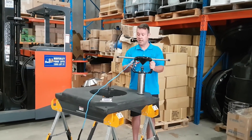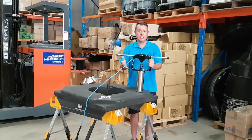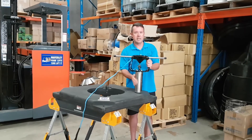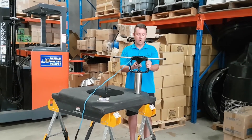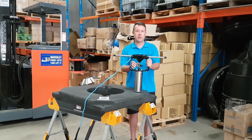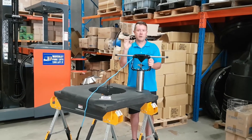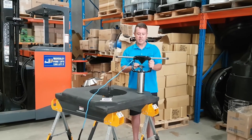All you have to do is every few months just come in here and wipe the outer cage of the motor to make sure that you don't get a biofilm building up on it, which acts as a thermal blanket and causes it to heat up. And being how easy this is to use, you don't have to unbolt anything. You can do this by yourself in a little tinny or a kayak — just literally pull it up out of the float, give it a wipe and off you go. Also a good idea to check the props and make sure that there's no damage on the prop.